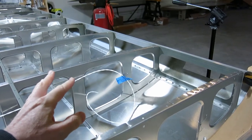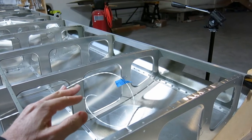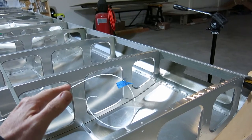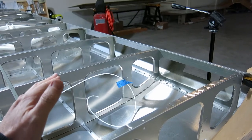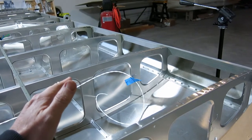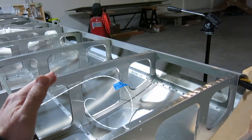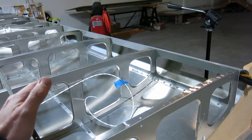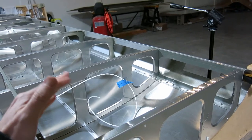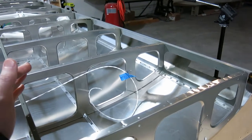with a separate switch. I talked to an avionics person who has been doing panel builds for experimentals for over 20 years, that's what he does for a living. He's very highly experienced. I asked him about the vertical power electronic circuit breaker, and he kind of cringed a little bit. He said they're not bad, but he's a little concerned that they still have multiple single points of failure. He said they work great, and if we're not planning to do any IFR instruments or get the airplane certified IFR, then it'd probably be okay, but he did have a little bit of a